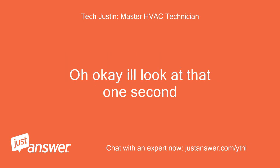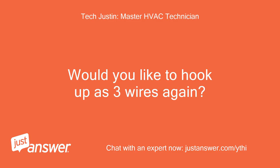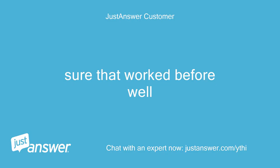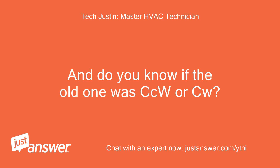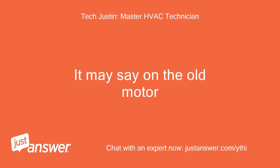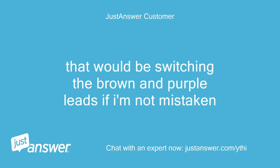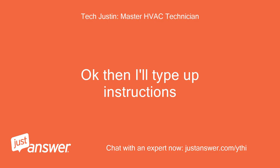Oh, okay, I'll look at that one second. Okay, I have the black one on correctly then. Would you like to hook up as 3 wires again? Sure, that worked well before. And do you know if the old one was CCW or CW? You may have to reverse it if we guess wrong. It may say on the old motor. I don't know, but I should be able to reverse it, okay? That would be switching the brown and purple leads if I'm not mistaken. Okay, then I'll type up instructions.